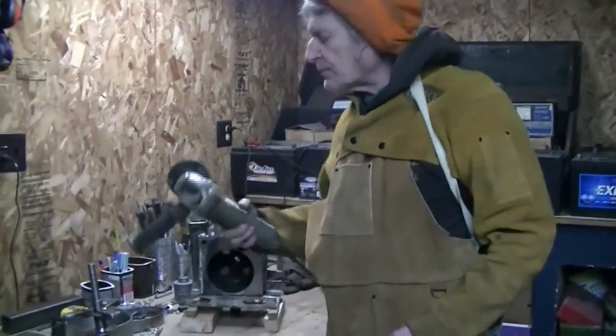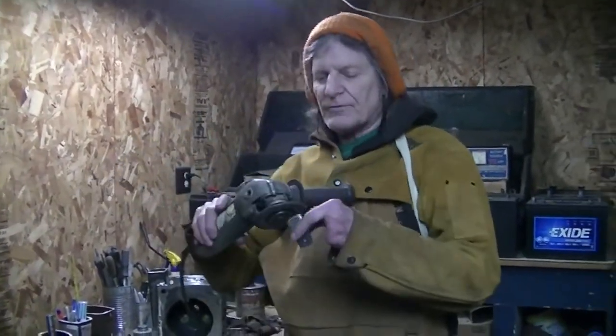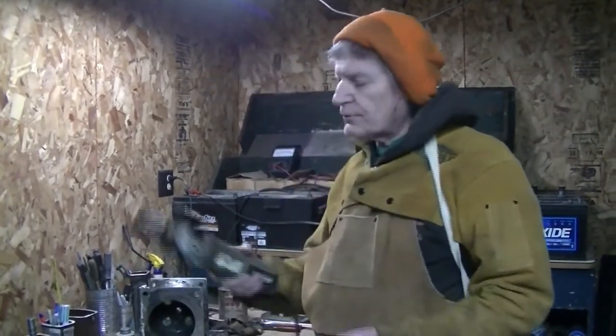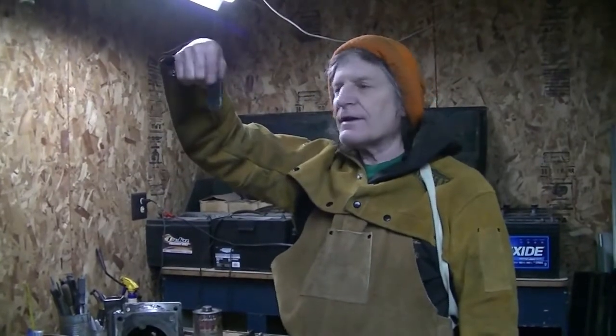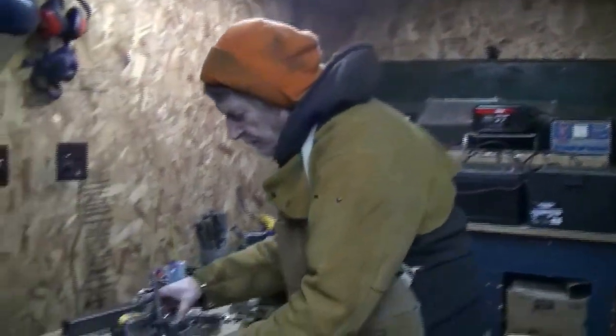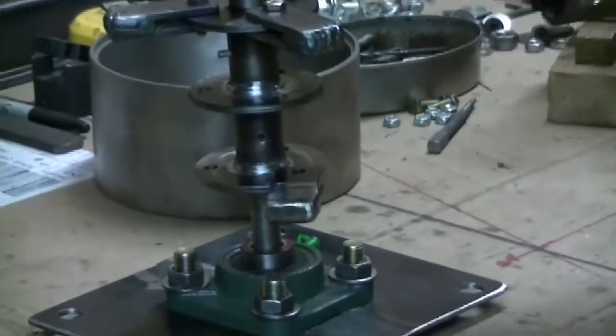After hogging off the rough material on that hammer, I used our handy dandy 4-1/2 inch hand grinder to actually do the shaping. This gives you a lot better control of shaping the last part of it. You can do all the grinding with that actually, but at least do the finished grinding with the hand grinder because it lets you round everything off nicely. Now you get a nice little hammer that will fit in there just nicely.